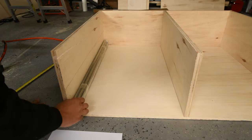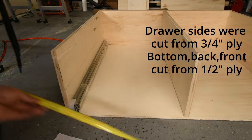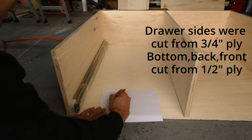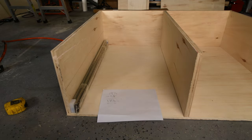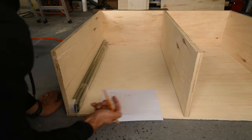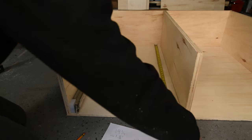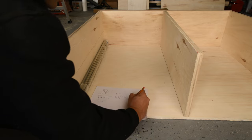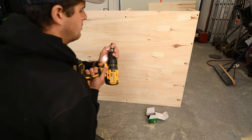At this point I wanted to figure out the dimensions of my drawers — the width, the height, and factoring in that the slides take up a certain amount of room on each side. The slides on each side take up three quarters of an inch for an inch and a half total. So once I measured my width, I needed to subtract an inch and a half for it to be the right size. I also need wiggle room up and down — you can't have the drawer exactly the same height as the opening, otherwise it'll rub on the top and bottom. So subtract about an inch to an inch and a half to give yourself room on the bottom and top. Once the wood glue dried, I flipped the project to drill pilot holes and put in my one and a half inch wood screws to secure the bottom to the sides, center piece, and backing.